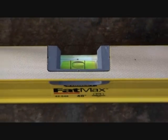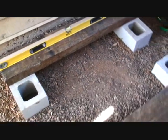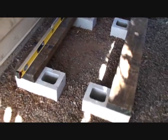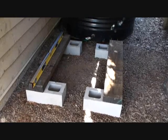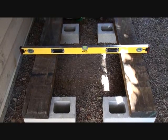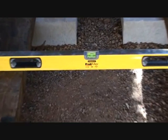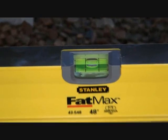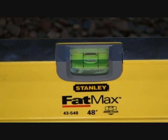Make sure you are always checking the levels. I found the mallet useful to make some minor adjustments and my foot to make some slightly larger ones — like if I had to make one end lower I would just give it a bit of a whack with my foot. Once I got a block level I would then check it against another block, putting the level across both of the blocks. Sometimes I had to make a few minor adjustments but most of the time I could get the heights correct thanks to the string line.